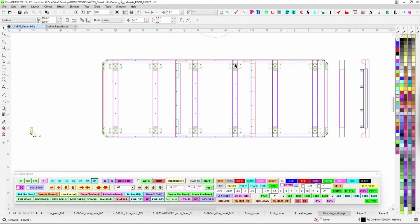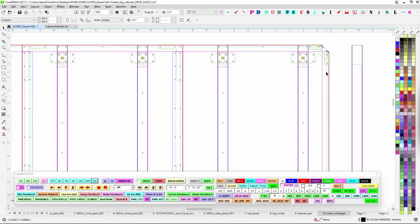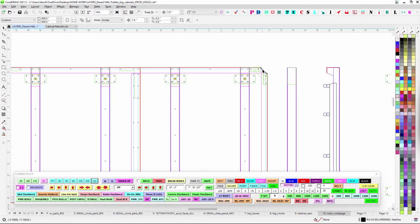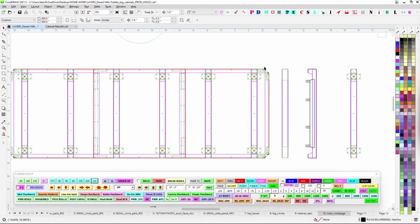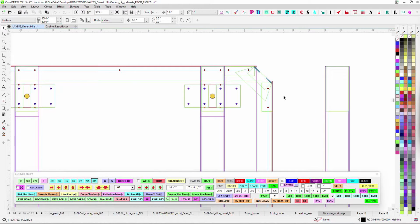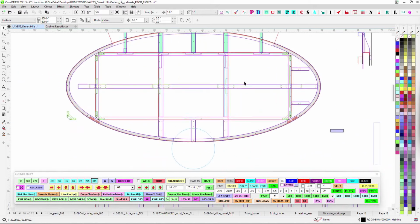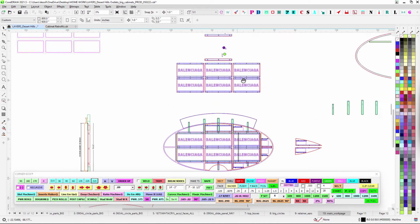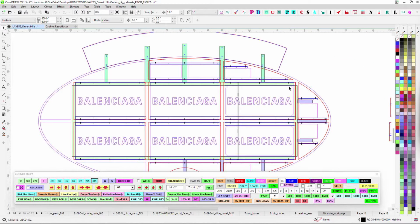So this is similar to the backer that we make on our shoebox cabinets, a lot of the ones that are out in Cabazon as it is already, except it's just going to be the frame. And then we're going to be applying faces to it. So you'll have your backer frame piece, which is about 4 something deep. We're going to 45 the edges there. We've done this before. That way there's clearance. And then it's going to get a series of C channels across the front. So that way we can then create openings for the slide-in faces here, the push-throughs.